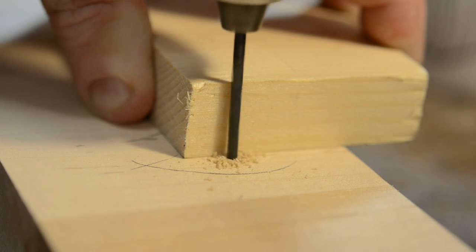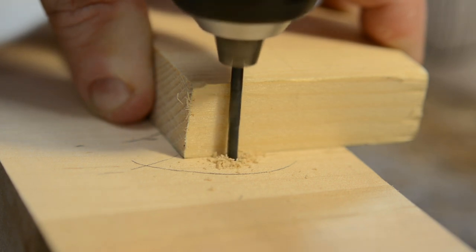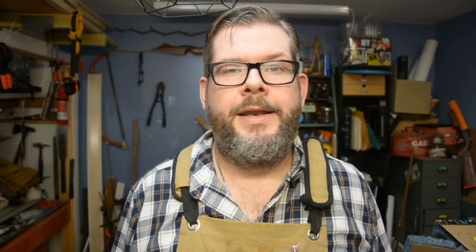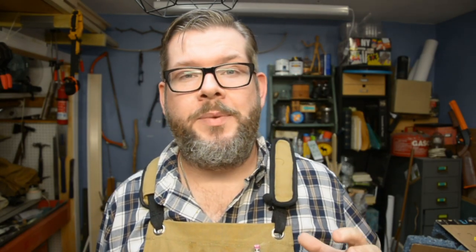Make sure you have a perfect 90-degree line to the edge, and then just keep your drill as perfectly straight as you can using that mark and the wood as your guide. Being that this is a farmhouse-style piece and not an industrial piece, I didn't want to have the mounting hardware out and prominently displayed, and the way I figured I would do that is to hide it underneath the hangers themselves.